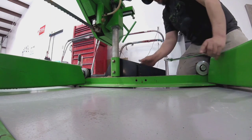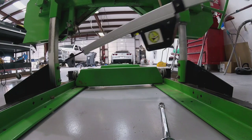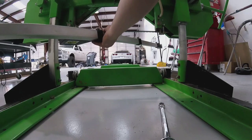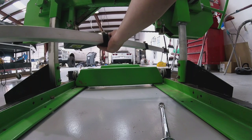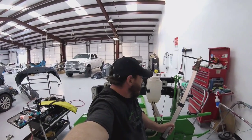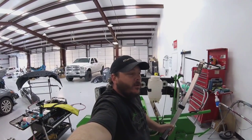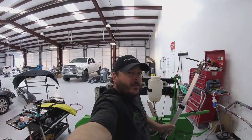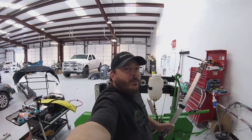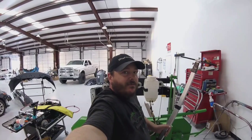With our vertical supports loose we can now square the saw. To square the carriage I'm using my auto body tram gauge to measure diagonally corner to corner, and then match that measurement diagonally to the opposite corner to corner. We've got it lined up well within specifications — and honestly when you push it, it does twist slightly, but I want it to be perfect so that when I set the track and lock it down in its welded position, I know it's going to fit.